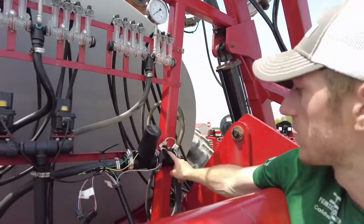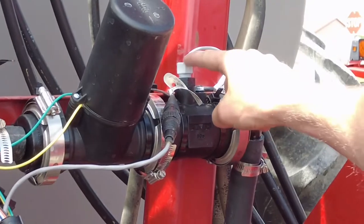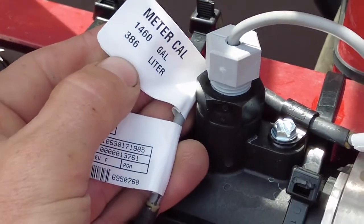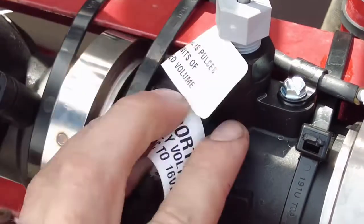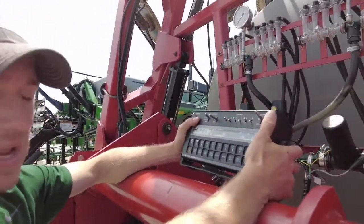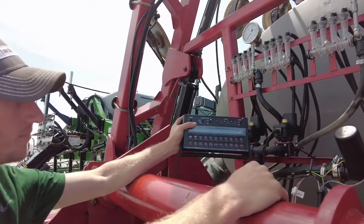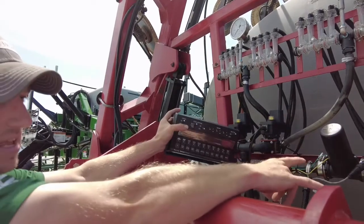The meter cal is attached to a tag located on the flow meter, which is right here. The flow meter is the unit that has got a silver-gray pigtail coming out the top, and right here on this tag it says 1460. If you flip that over, it says per ten units of measured volume. On the Raven screen we're going to enter in 1460, but with a rate controller like a John Deere or Raven ISO we're gonna have to enter the units — it'd be per ten gallons. So on the meter cal it's going to be 1460, which is how many pulses that flow meter makes per ten gallons.